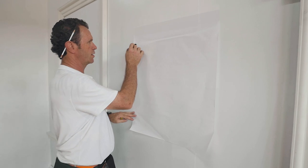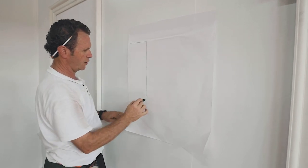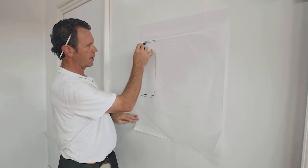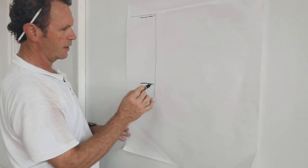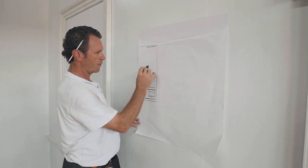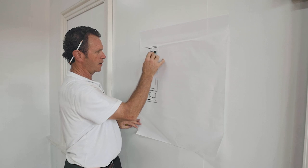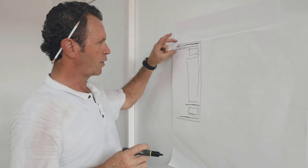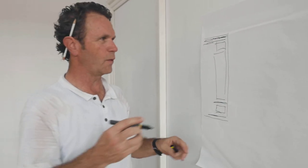And so, if we have this section of our room, the simplest is just a base molding and a crown. Then you introduce a chair rail. Then you begin to introduce a wainscot, right? A panel wainscot. Then you actually have a panel here, maybe another panel here, or maybe you introduce a lot more crown details. If we're going to focus on the crown, there's three different ways to do that.